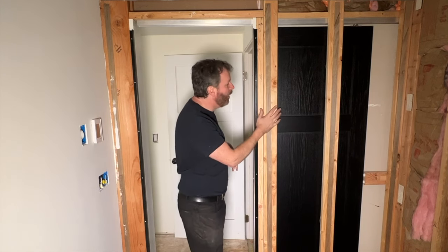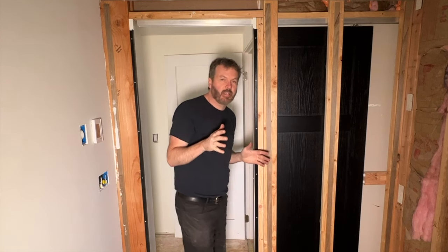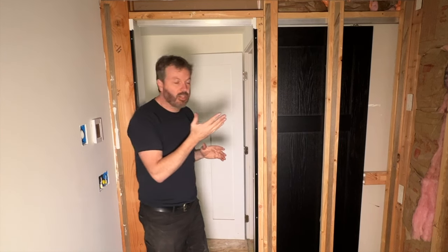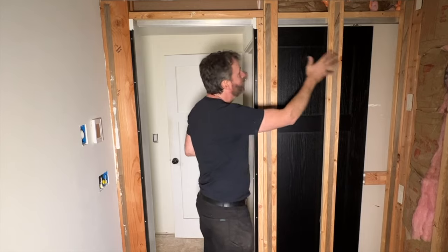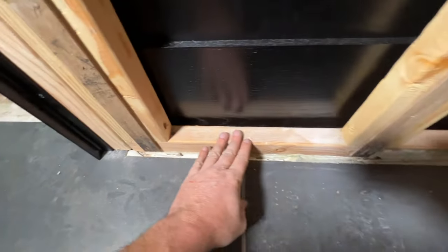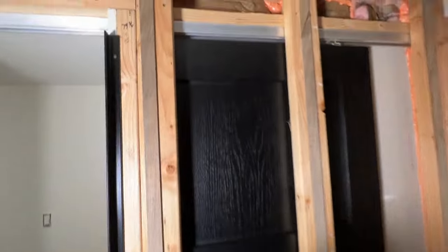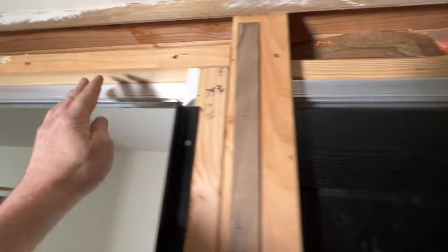I build my own out of 2x4s that I turn on their sides. Sometimes I've made them out of 2x6. Now, it's important to get nice dry lumber for this that isn't going to twist later. I put up my 2x4s — let me show you a closer look here. I just have 2x4s turned on their edge for the framing, with a 2x4 here at the bottom turned on edge, and I've toe-screwed these boards in. Then up above, you can see I have a board at the top that I have the track attached to.